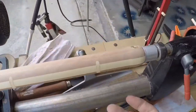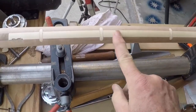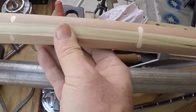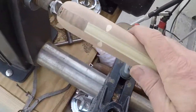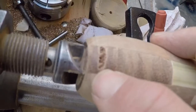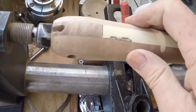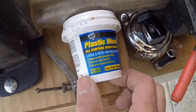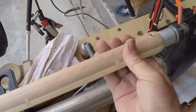Here's where we ended up — came out pretty good. I put my aluminum ferrule on there; I still need to epoxy it. The dowels I put in had a kind of interesting effect when I turned them down — I got into the cavity where the dowels actually were, and they turned out to be these neat little splices. I sort of necked it down in the center and left it a little bit big on the two ends. Here's where my problems were: I got a nasty little tear-out on the mahogany, and where the magnet is I got into the little cavity. I'm going to do the cardinal sin of using a little plastic wood filler there, then sand it back and stain and finish it.